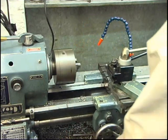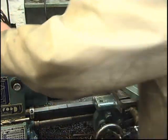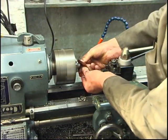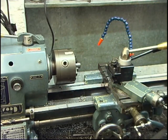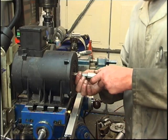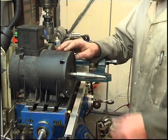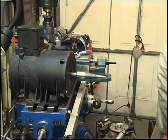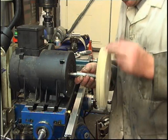That was the two extremes - moves really fast, chatter; really slow, no chatter, nice finish. It's just a case of experimenting until you get the result you want. I don't even know what sort of steel it is. Think we'll try it on - it's still quite warm. Nice fit. A couple of grub screws in there - the wheel screws on like that. Way you go.